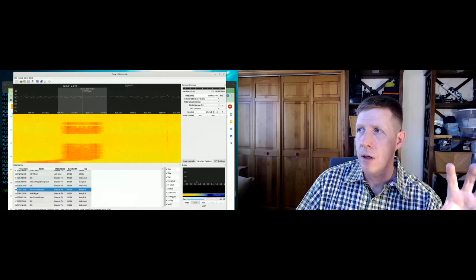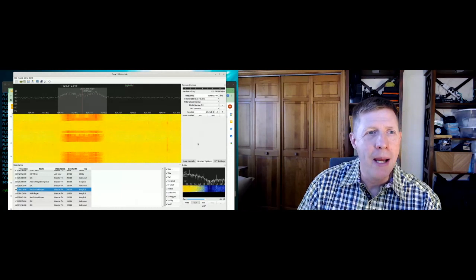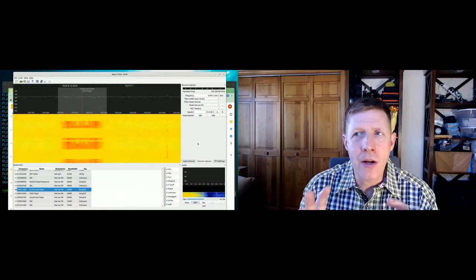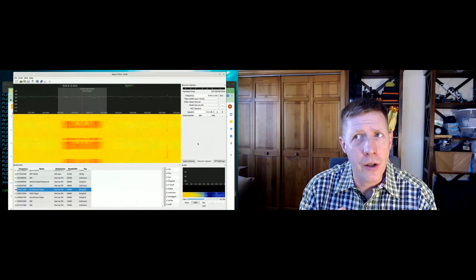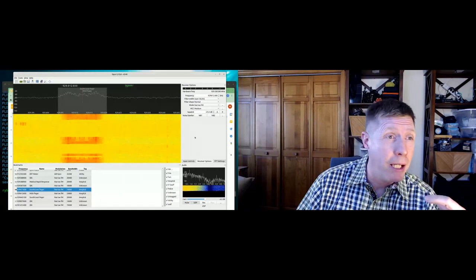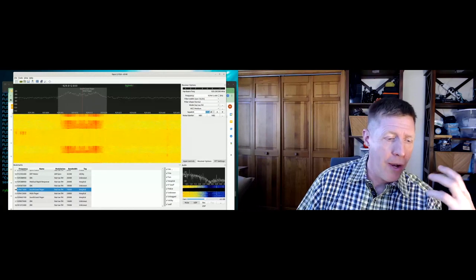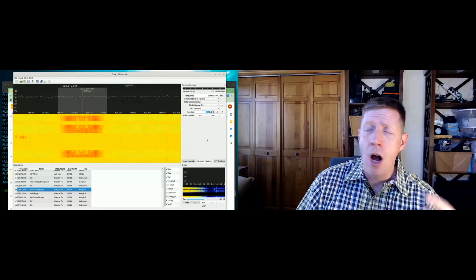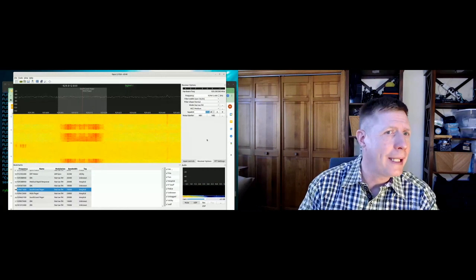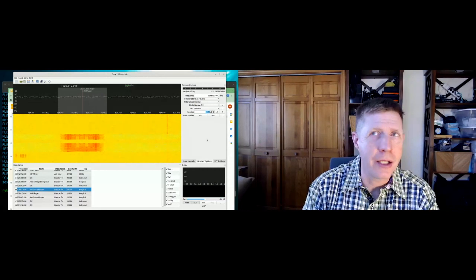Unmute myself, and I'm going to listen to that sound, right? And I should be able to hear, here's a nice clean sound coming there. If that sound is kind of dirty or it has a lot of interference, or if you're tuned off frequency a little bit, or your squelch here is tuned so that you have a lot of extra interference, all that changes the audio quality as it's streamed out to your NCAT NetCAT that's listening there. So the cleaner you can make that signal, the better.